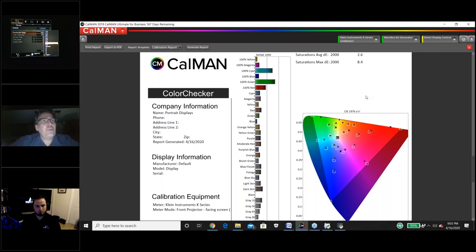So that is HDR projector calibration 101. There is a different layer to that called BT.2390, which takes into account low luminance display values, which is kind of a whole other class we could do at some point. If you want to throw that out there in a couple of weeks, we could actually do some HDR calibrations using BT.2390.